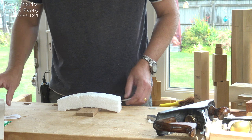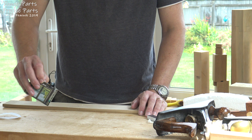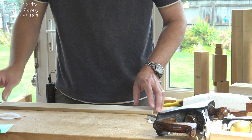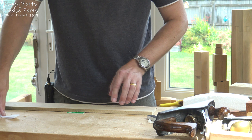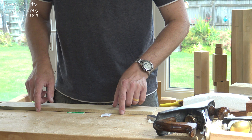What I tend to use a lot are credit card blanks or membership cards — reasonably thin plastic, probably about half a millimeter or so. Don't use embossed credit cards because if you plane over those a lot you could find that your credit card number ends up being embossed in reverse on the other side. Generally speaking these work really well — you can slip one under a concave surface. Other parts of the board you might find a gap between the high point and the lower point; maybe shims of a few thicknesses of paper there will do the job. As long as you put enough supports in on the concave surface, the convex surface on top will remain stable and you'll be able to plane it flat.